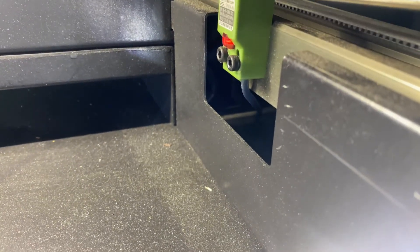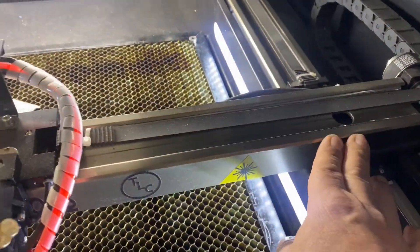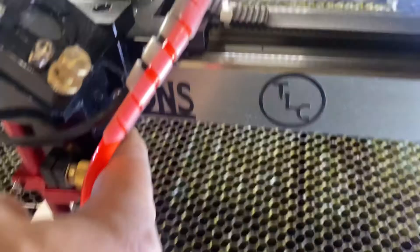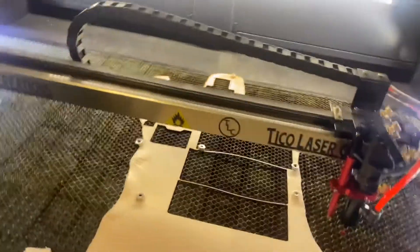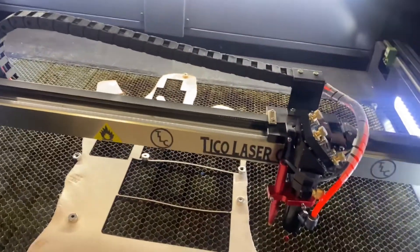See, the light comes up. So my sensors are just fine. If I have a machine and I test the sensors and they're fine, most likely you're going to have a wire or something that, when the metal from this head or the metal from the rail is approaching, is blocking the sensor from reading it. That's an easy fix — all you have to do is move whatever is blocking it out of the way and it will just start working just fine.